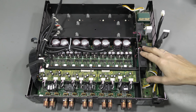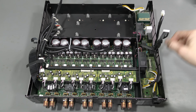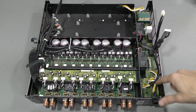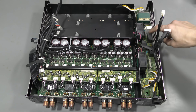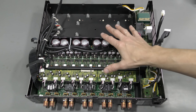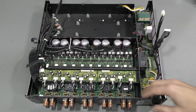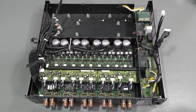Looking at this power board and the schematic, I see that the top part receives mains power without any switches through this cable. This connector controls three relays and two fans. Two relays switch on and off both sides of the mains input through this switch mode power supply for the power amp. The third relay bypasses the inrush current limiting resistor after a while. So nothing here is turned on until the top part decides to turn it on — and it does not even try. So it seems to me that this power amplifier has nothing to do with the problem.